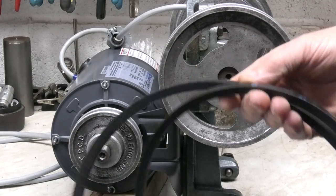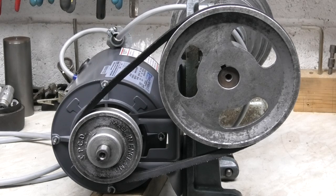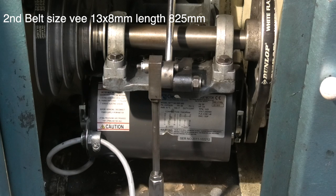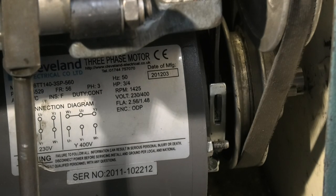My new belts have arrived. I'll just adjust the tension and I can fit this back in the lathe. I've fitted the motor and put the new belts on, ready to test. I had to make a few adjustments — the motor is bigger than the old one. Although it fitted the cradle okay, I've had to move the cradle as far to the right as possible, and the motor spindle is about a quarter of an inch away from the cabinet. The pulley on the motor shaft is as far across as I can get it, just leaving a small space for end float, and the top pulley I've had to move about a quarter of an inch along the shaft to get it in line with the lower pulley.